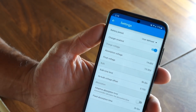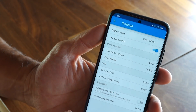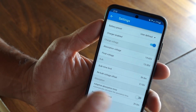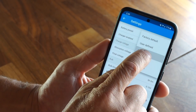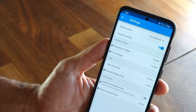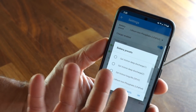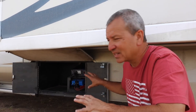We're running it as a charger, so we set up that mode. Just like the other Victron charge controllers, I can go into battery settings and have access to all the different charge parameters. I'm set up as a user-defined configuration right now because I'm directly setting the charge voltages to match my other solar charger so everything is in sync. If I wanted to just use a preset, I can select lithium-iron phosphate battery and it'll automatically load the default setup for lithium batteries.